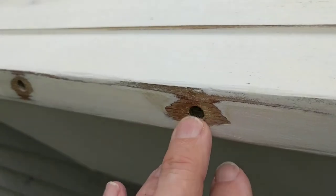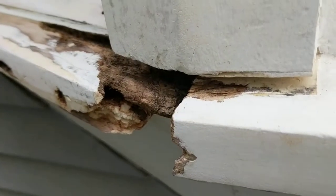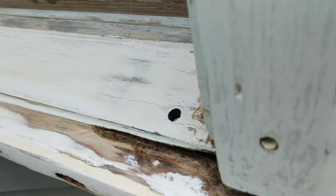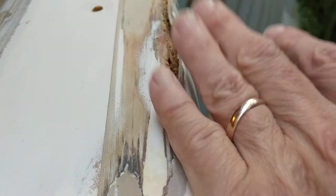We've been getting a lot of rain recently so I have to keep it covered. Look at how bad that section is — but I'm going to try to put the epoxy in completely. I drilled three new holes on the sill top for the borate rods. I'm down to just five more borate rods, so I'm using the liquid Boracare product to pour into these sections.